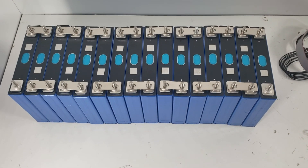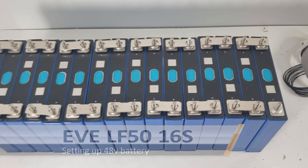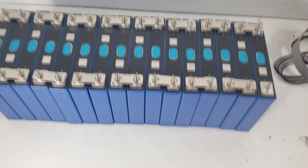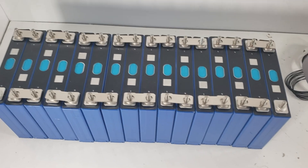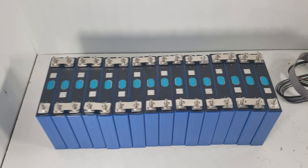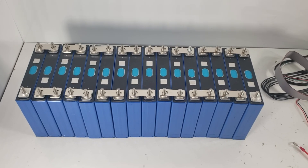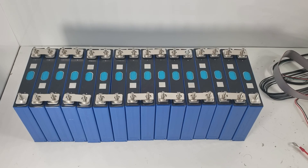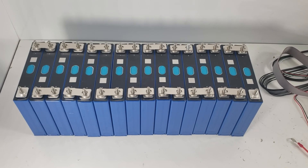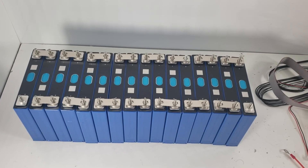We've gotten some LF50 cells and arranged them using these little tiny bus bars. Now, this is 48 volts, so you have to be careful — if you touch the positive or negative on 48V it will probably shock you. It has enough voltage to actually penetrate the insulation layer of your fingers, so just be careful when working with these higher voltages. We're going to begin installing the balancing wires and tightening them down with nuts to clamp everything together. It's not going to be a super tight fit since we're just doing a demonstration, but this should get us to the point where all the cells are connected and we can power up the BMS.